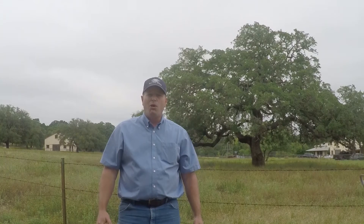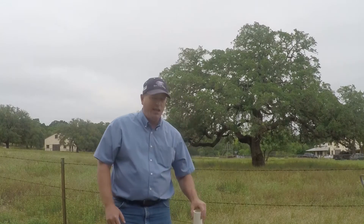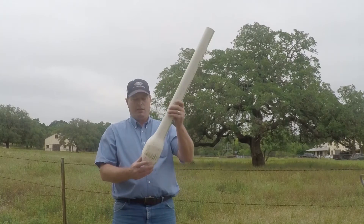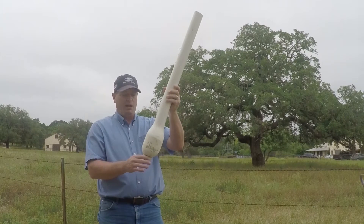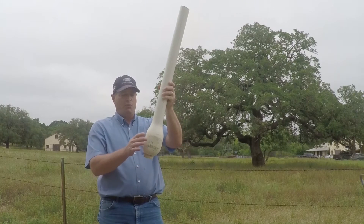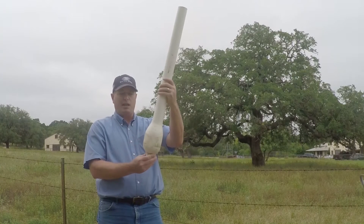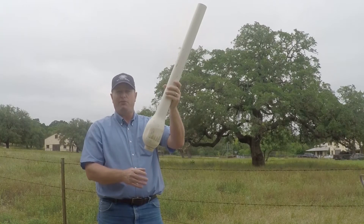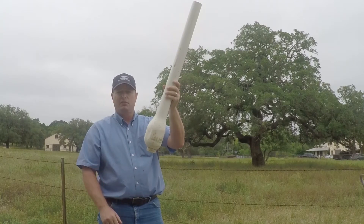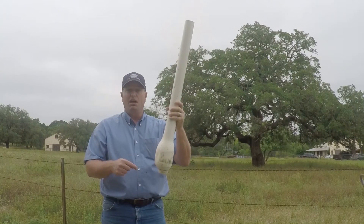When the pump is running, the water that goes through it is not only lubricating the pump, but it's also cooling the pump. I have a little piece of pipe here with me that's been damaged by the pump getting hot. The pump ran without water, and the water inside this pipe was so hot that it melted this pipe and caused it to swell out. Eventually the pump fell off the bottom because it messed up the threads. This kind of damage is also happening inside the pump, melting the impellers.